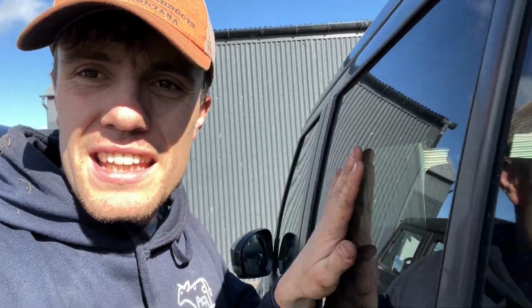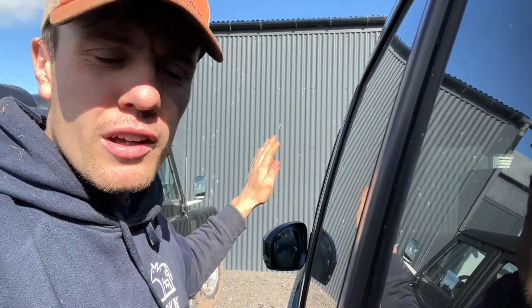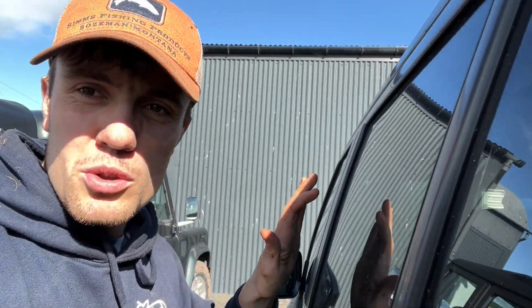If you imagine I'm inside the wire right now and this is the edge of it, if the signals of light come at a shallow angle, they reflect off it, whereas if they come at a harsh angle, they go through. So that's why it doesn't bend so much. So they send light signals and it just bounces its way along the inside of the cable. The technical lingo is to do with angles of refraction and things like that.